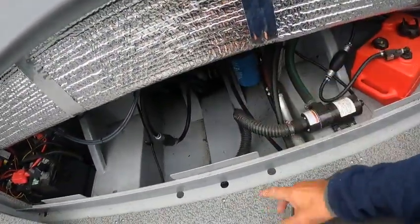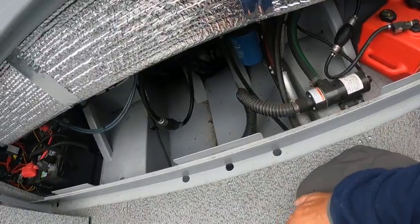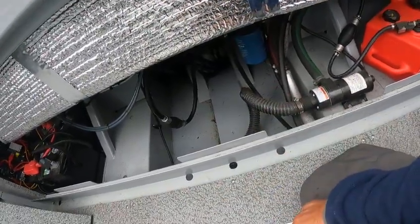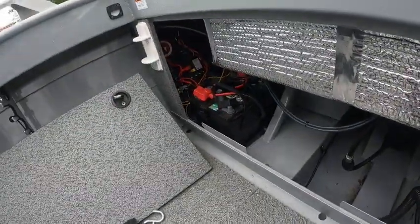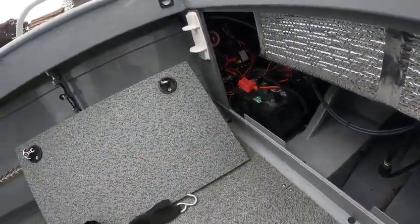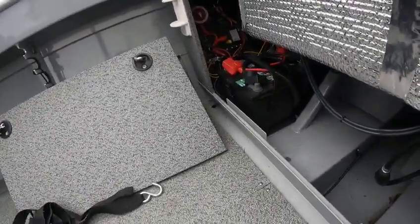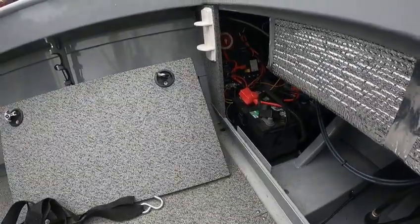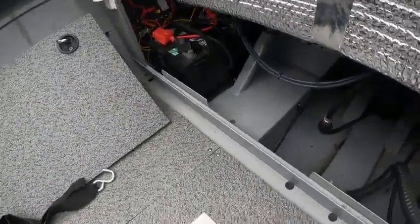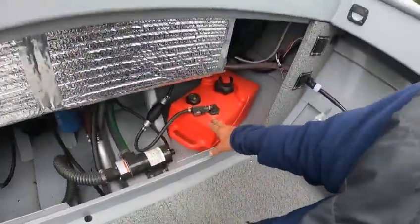Yamaha 10-micron - the best filter, stick with that. Yamaha does have a couple good things like Ring Free, their filters are good. Corrosion X is good, Salt Away is good. Some of those aren't Yamaha products but they're good stuff. Take the Corrosion X - see that whole panel over there with your terminals - spray it down every six months to a year or at the end of the season. It'll keep all corrosion off. You got corrosion buildup, spray them and heat it right up.